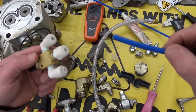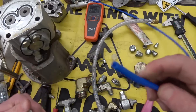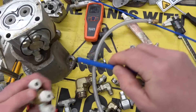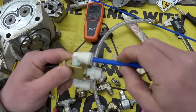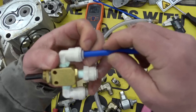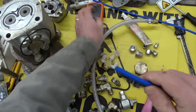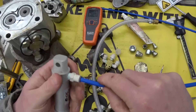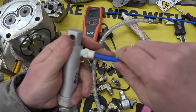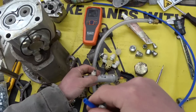Then for low pressure industrial and automotive applications, we have push locks. These are just nylon hose tubing — pushes in like that, seals up and locks, and then they are reusable. You just pull on them and they come right out. I have them on little tiny cylinders and process automation. Pretty ubiquitous, cheap, super convenient.